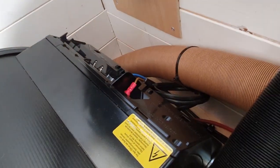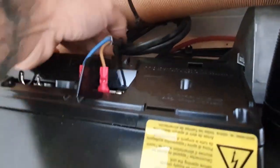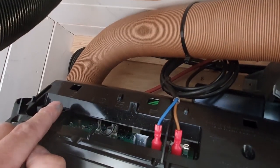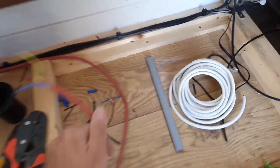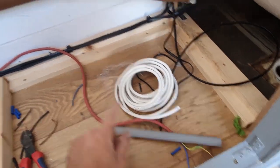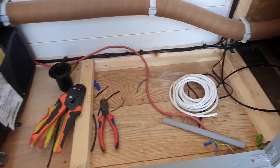The 12V is connected - just some spade connectors crimped on and pushed on, as easy as that. I secured the cable to that pipe. There are the thermostat connections - everything is push-connected, which is great. There's the controller, just an RJ45 connection. The 240V comes pre-flexed - looks like 1.5mm heat-resistant flex. Because it's not long enough to reach my spur, I'm going to through-crimp it onto my bit of 1.5mm heat-resistant flex, clip it round, put a bit of heat shrink over the joint, and bring it up into my fuse spur.